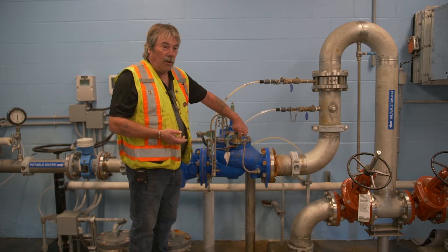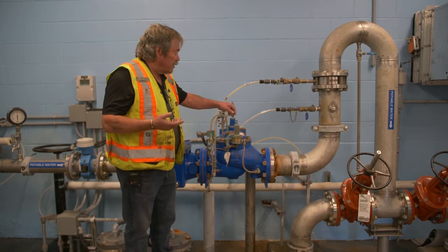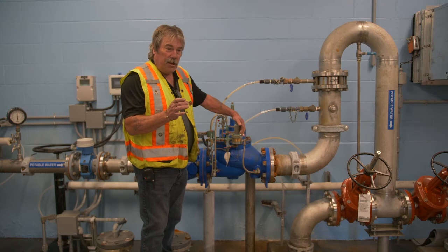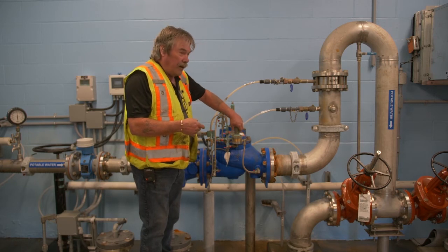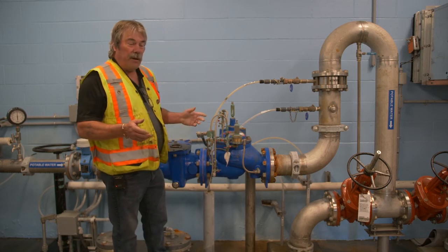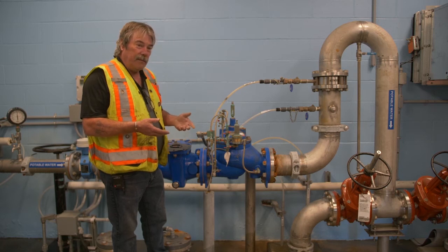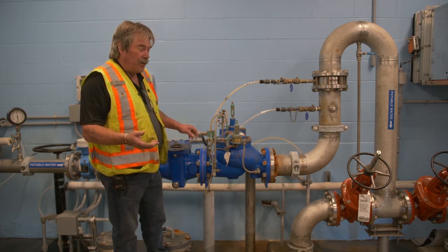This little diaphragm in here is very important, and this is the one that can give you a lot of trouble. We found that lots of times we don't have them. There's three different ones: a four-bolt one, a six-bolt one, an eight-bolt one. If you get the wrong gasket and it's the right size but it's got six holes instead of eight, just put more holes in it — better than the one you've got because it's not working. One time we fixed one of these valves with an inner tube out of a tractor tire. We left the original diaphragm in because it has a fiber in it, but the rubber inner tube does not — we used it as our diaphragm with the fiber one to hold it in position. It was temporary until we got a new part.